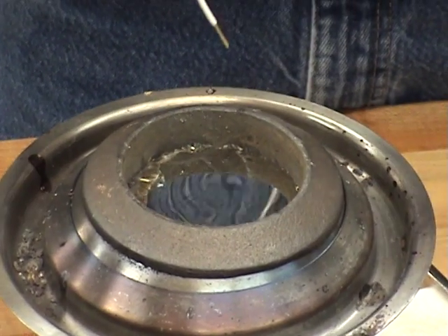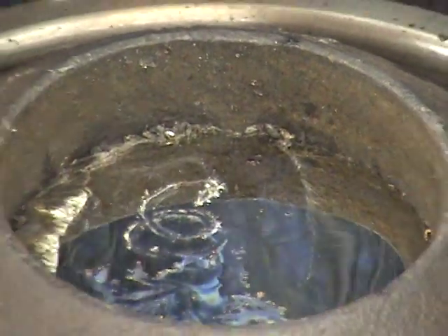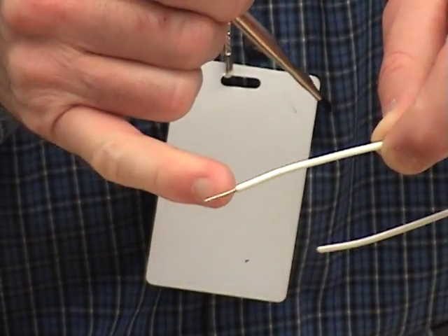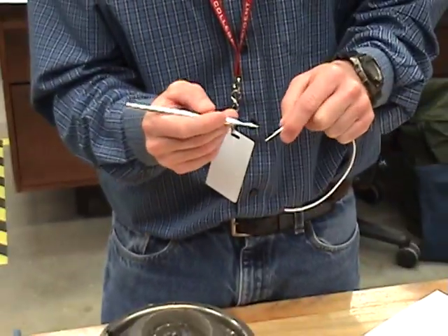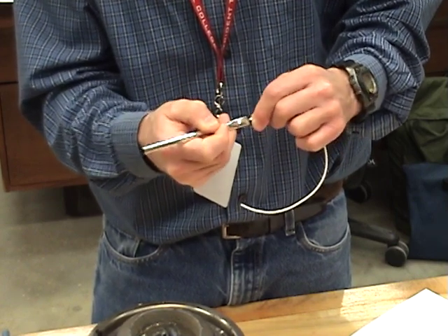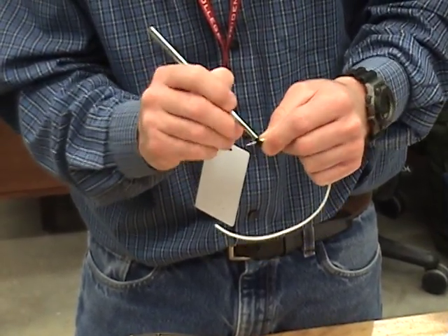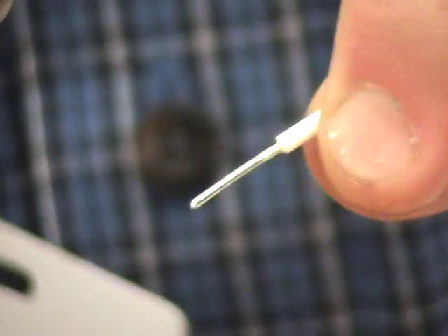I'm going to take my wire that's already prepared and make a figure eight, not going all the way up to the insulation, just leaving a slight gap, and pulling it out. Now my wire is tinned. However, there's still flux, and I left myself a little half a millimeter gap — approximately fingernail width. So I don't want that wire to wick up underneath my insulation. When adding the flux, I try to keep the flux from going up under the insulation; it's not always practical, but that's your goal — so the solder does not wick up and, due to capillary effect, get sucked up into the insulation, where it becomes very stiff and brittle. Now the wire is clean and it's tinned.